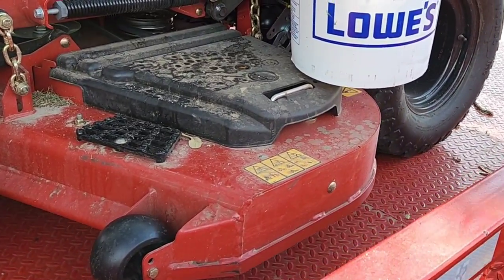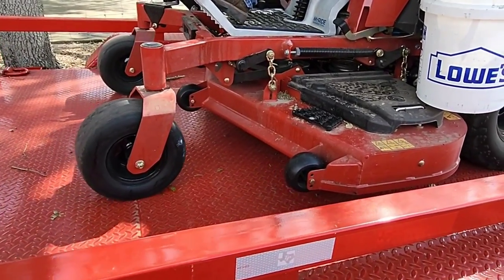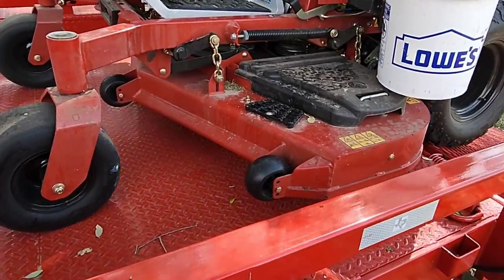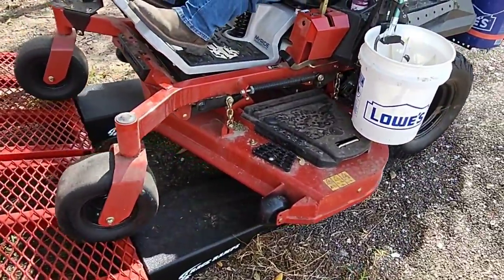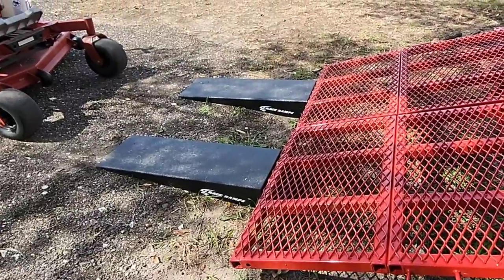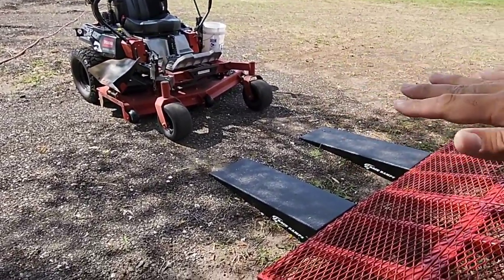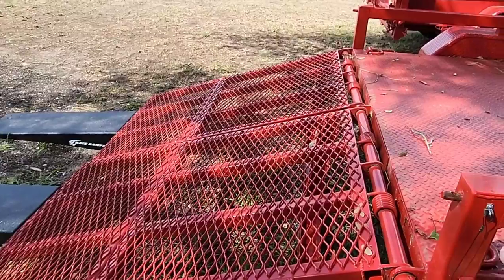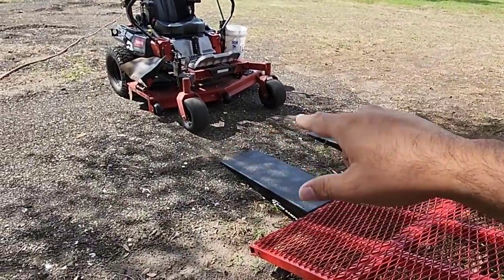Let's see what you can do coming down. Perfect. So it looks like we only really needed that extra half inch of clearance going back down, which is really nice. As long as you just press down on the deck lift pedal, you can raise it up just a little bit more to prevent it hitting. You can imagine how difficult this could be without the clearance and how you can damage things — the bottom, possibly the bolts holding your spindles in place, because things stick up here that may not be completely flat with what's under the mower.